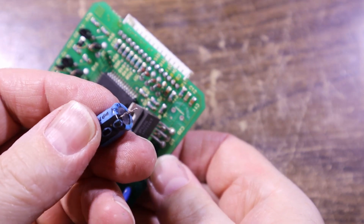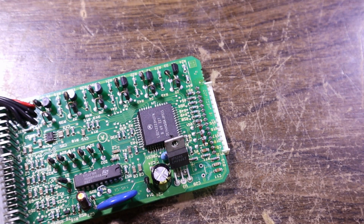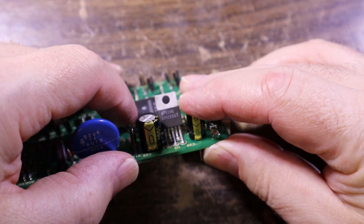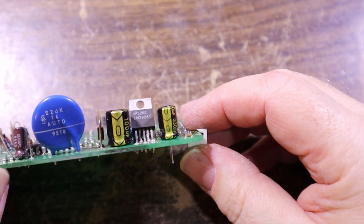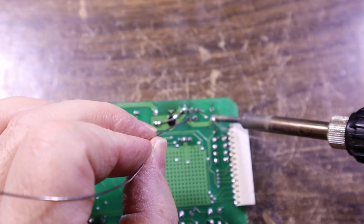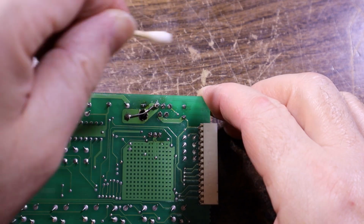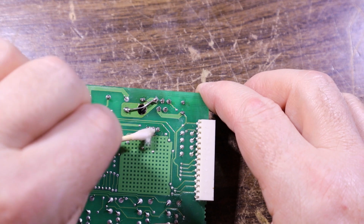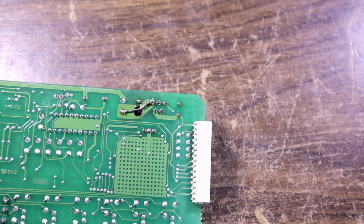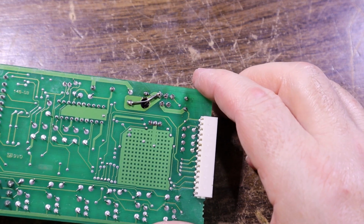It may have started to leak. It could just be old and fluxy, or it could, yeah, just a little something around the pins there. Not surprised. There we go. Much better looking than blue. What was that, 30-year-old blue? Make sure there's no flux hanging around the pins of that oscillator. You don't need anything to upset that, although it's probably quite a low frequency. It may not really matter, but you never know. Awesome.